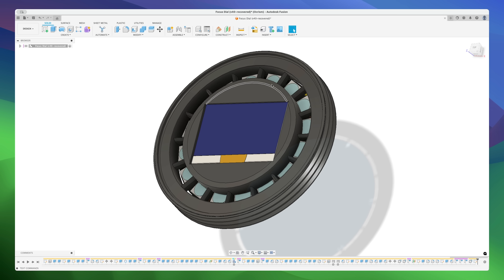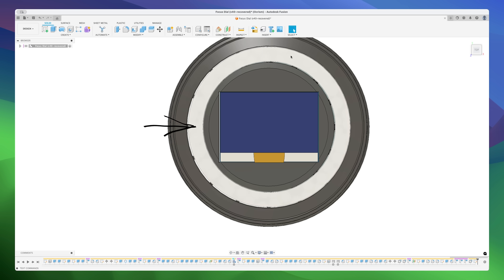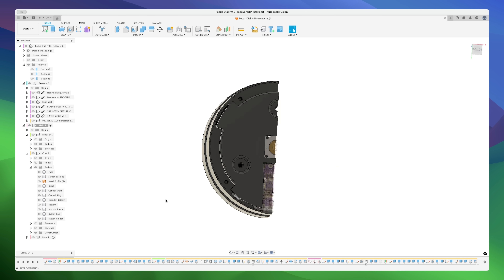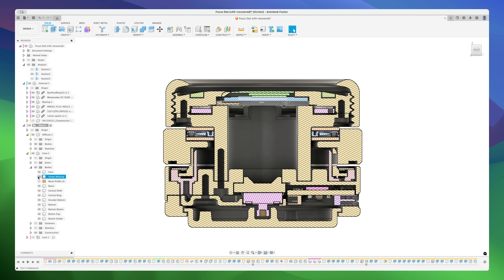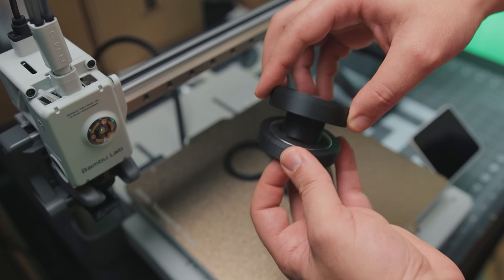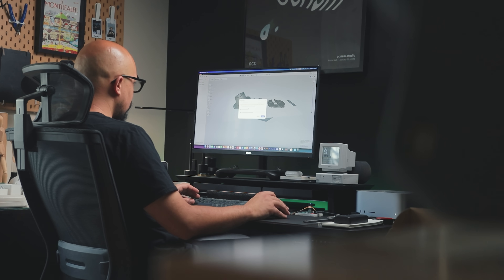The face piece holds the display in the center, and these baffles are meant to separate the LEDs to avoid any light spill and create a ridge to hold the lens. I'll later put a diffuser in this channel to have a smoother light ring. We have this hollow stem that will be the rotational axis for the encoder and will also have wires running through it to connect everything to the microcontroller. I then added a little platform to center the button and three springs to support the assembly and provide a stiffer click. I did a few FDM prints to test things, especially the top shell that threads onto the face of the device. After adjusting a few tolerances and iterating a couple of times, I felt it was dialed enough, so I sent the design over to the resin printer.